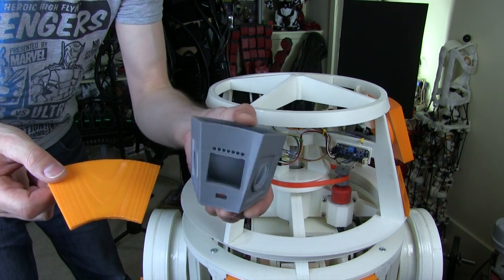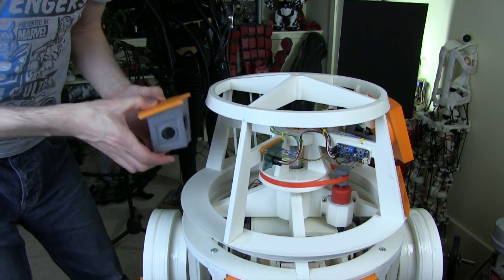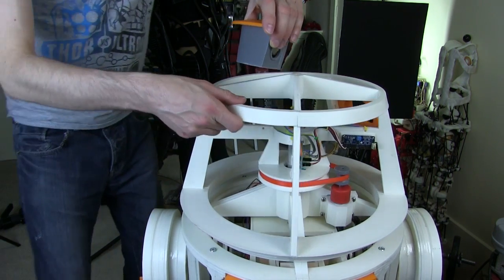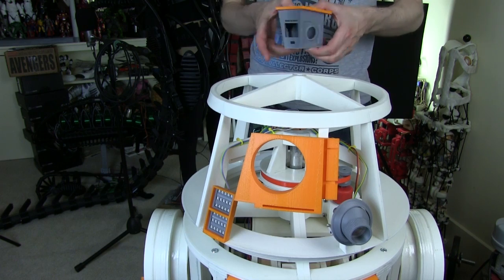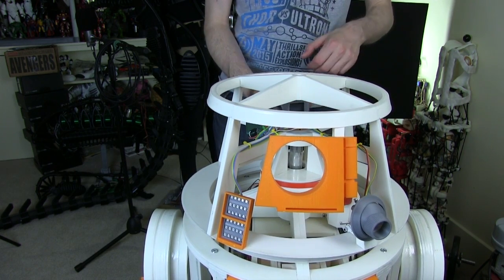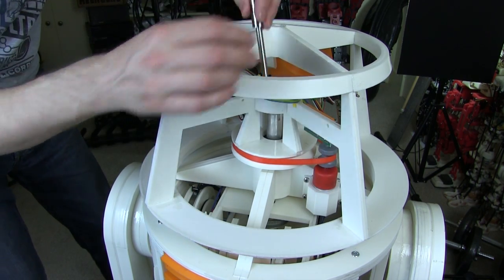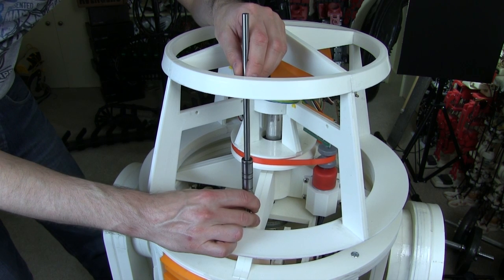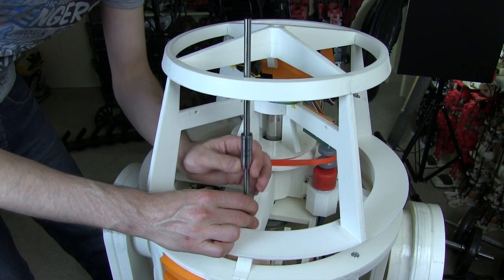Here are the parts that I've printed - they've come out quite well, obviously the lid fits on there. This fits quite nicely in here just at the back, opposite the radar eye, and then it will hopefully pop up and the head can turn all the way around. The periscope can look around, turn in the opposite direction, and then eventually pop away again, held neatly inside. I've now got some linear bearings for my rod which have little ball bearings in them and slide really easily on the 8mm bar, facilitating movement up and down while holding it parallel.